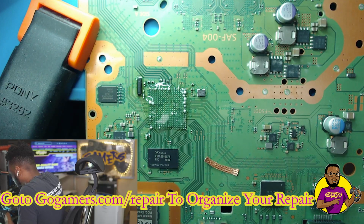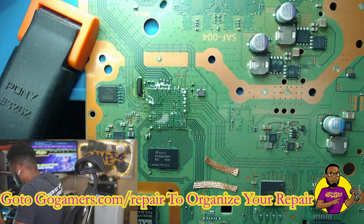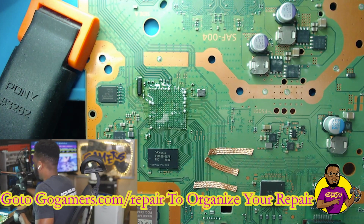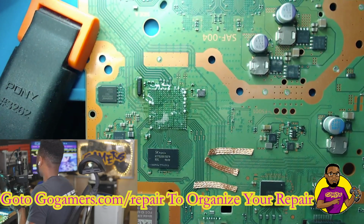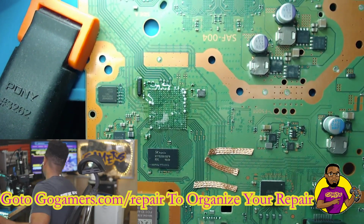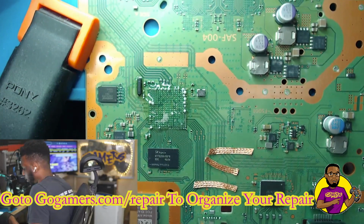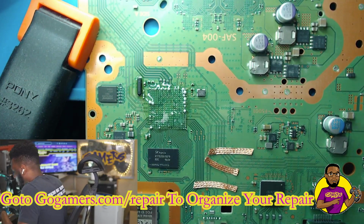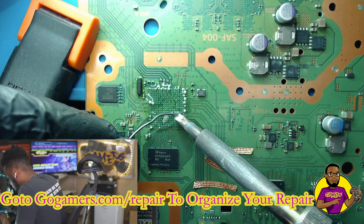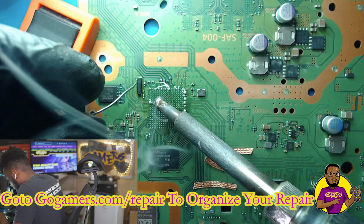So I'm going to pre-cut 3 strips, like so. And all we're going to do is go around and start to desolder. But first I'm going to put low melt solder on the board to make sure that we can easily remove all the solder. So we're going to use low melt. The type of solder that I use, the link is in the description as well. So here's the solder strip. Let's get that applied. And I'm just going to move around in circles.